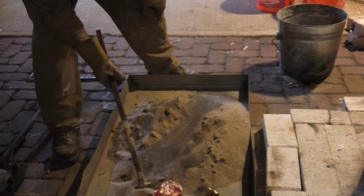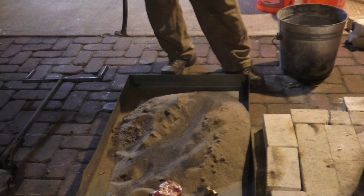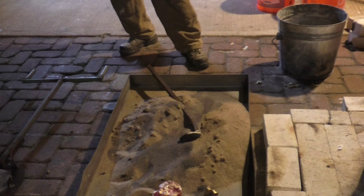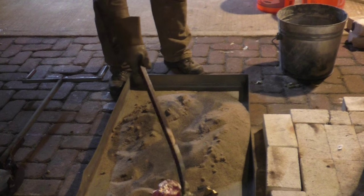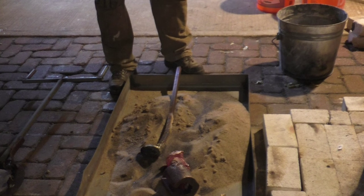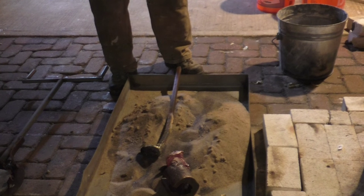That's not a good way to make a casting. But you know what? If I went back to step one — maybe this would work — which is: you take a foam pattern, dip it in sheetrock mud, let that dry on there, or slip, or anything else, then put that in the sand and pour, to maintain the integrity of the walls just a little bit longer. We ought to use a pour sprue — we could cast something out of sodium silicate sand for the sprues, like a pour cup, so the metal hits it and it doesn't erode it. Because when we're pouring it, it's hitting that sand and washing it. So a top layer of sodium silicate — actually all the pour cups, right down to the part. So you always have this funnel, you pour it, it hits the foam, goes through the foam, fills up, and becomes your riser — your pour cup and your riser all in one.